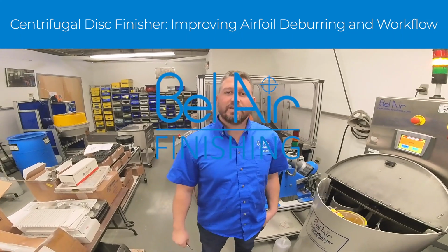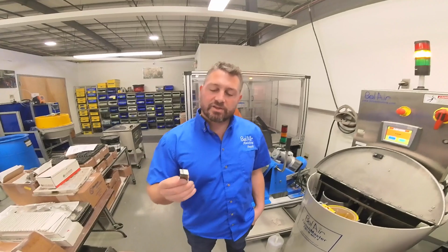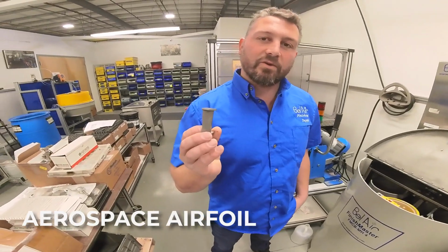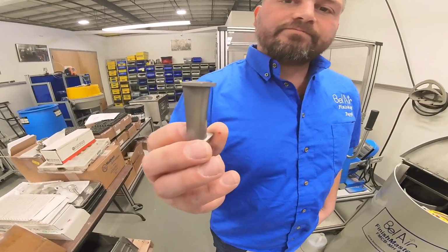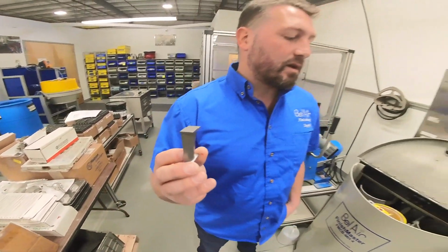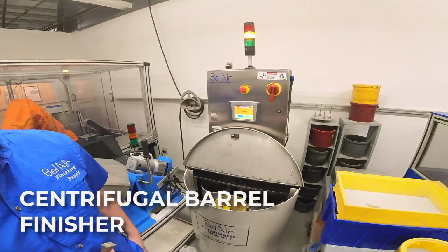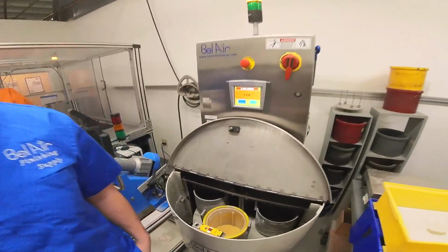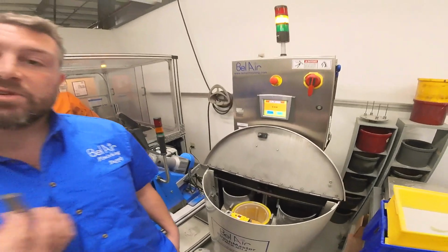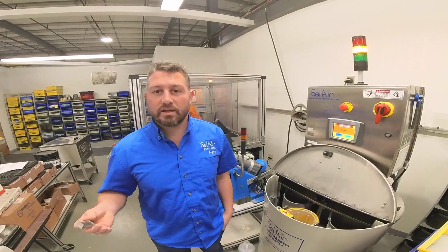Hey, I'm Steve Alviti, and today we're going to talk about one of our clients who came to us. They're a precision machine shop, and they manufacture airfoils for the aero industry. Currently, they're running a process in a centrifugal barrel as step one. Then they go to their machining op, and then they come back to a second step in the centrifugal barrel, and then to a clean, rinse, and dry.